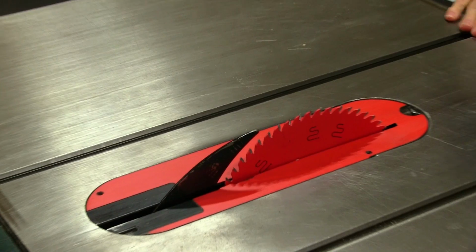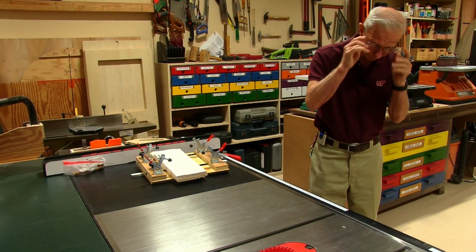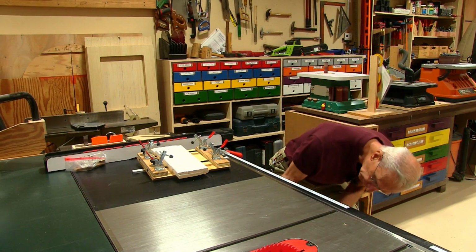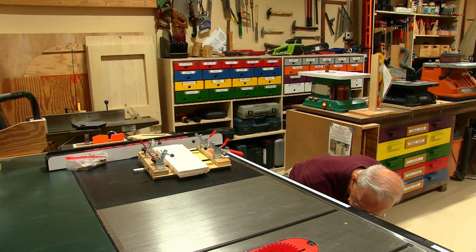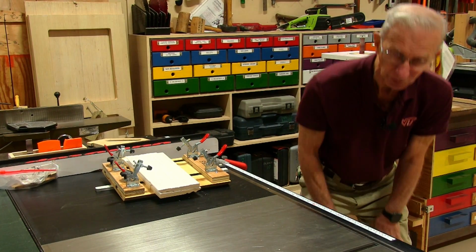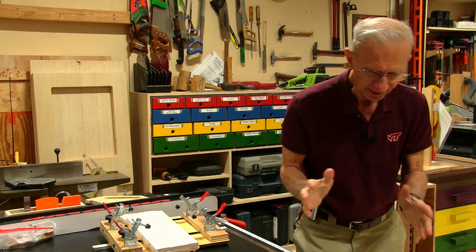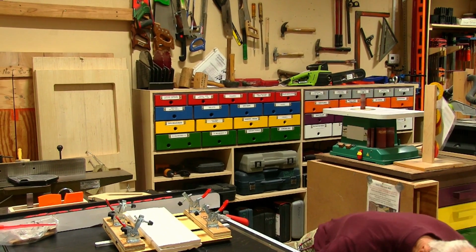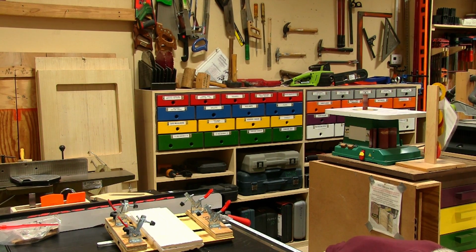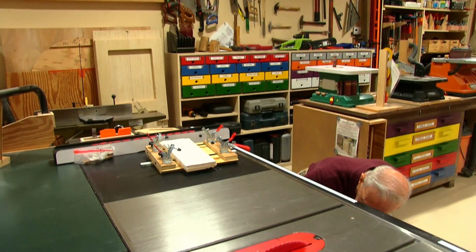So we do that. Now you remember from orientation and everything that the SawStop will go to a 45-degree bevel using the normal insert. You don't have to have a special insert with a big hole in it. We keep the lock on the bevel adjustment of the saw locked. The elevation one, remember, we don't care. You can lock it or not lock it, because everybody's supposed to check it when they use it. So we're going to go right around here, and we're going to do 45.